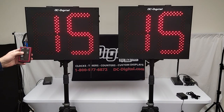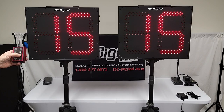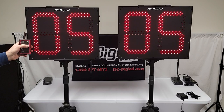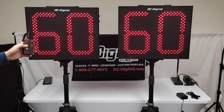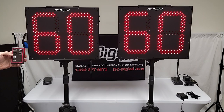If I push and hold reset three, you can hear a tone — a beep — when it goes into programmable mode. Up here you can see on the controller that it's sending data. I'll push reset three again, and as you can see it starts to count down and goes into set mode. I'll push the set time button to set it back to 60, push reset three again, then set time to get to zero, and finalize by pushing reset three again. It's locked into EEPROM so when you turn the controller off and back on, it will default back to 60.